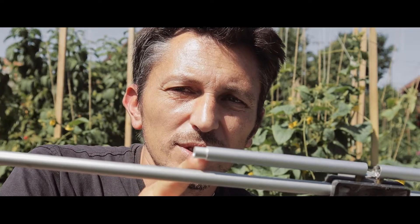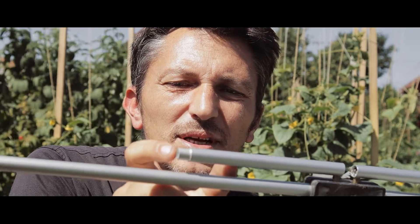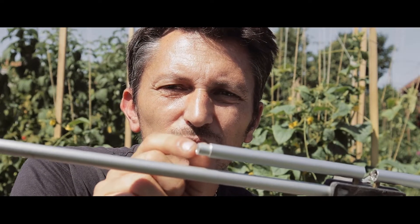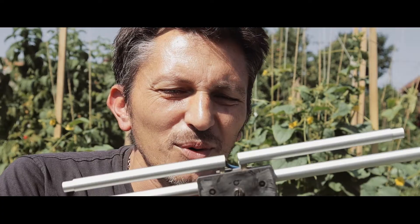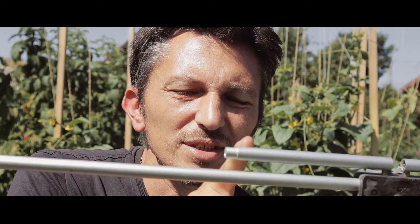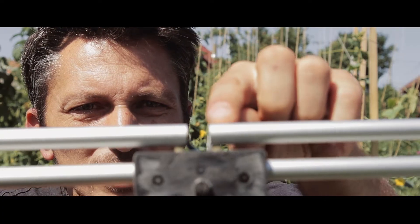I did the same thing for the 70 centimeters portion, but that element is only 5 centimeters long — currently extending about 1 centimeter on each side — and the SWR is great on the 70 centimeters band as well. The antenna came out really nice. I like that I can adjust the SWR on both bands. I check the two meters band first, then adjust 70 centimeters, then come back to two meters to make sure they haven't influenced each other.